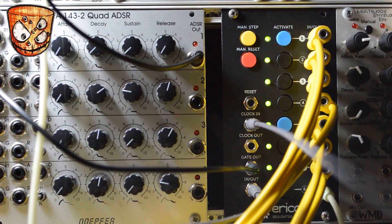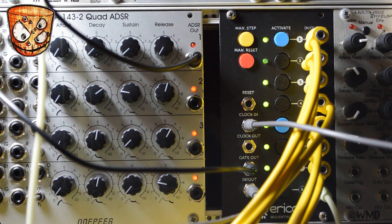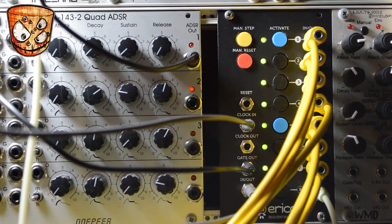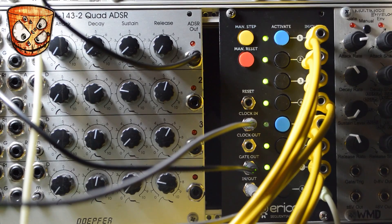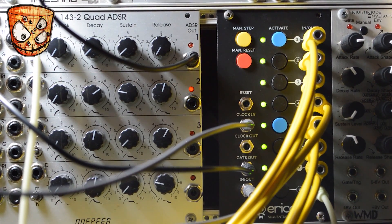Just to go through that again — here's the normal clock, and here's the audio rate clock from the same oscillator as the input to the switch. Here's a few different pitches. And because the AFG has also got a sub output which will be half the clock rate of the waves going in, you can also take that out to give a different audio rate, which gives us an octave below the waveforms going in.